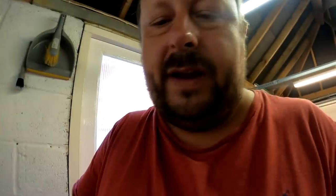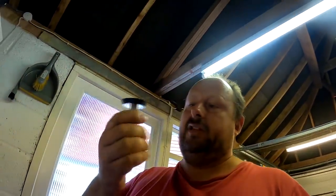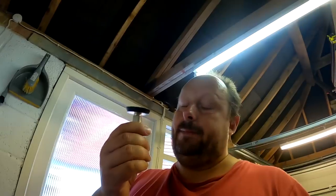You have to be careful because there's a little safety mechanism here. The rotary plate has a little bar in it, so there's a hole drilled in the Flex proprietary 30mm plate so it can fit in. The 75mm plate doesn't have that hole, and that's a means of stopping you putting the 75mm plate on this machine. Flex did that because the machine probably doesn't have the power to handle all the scenarios of using a large pad — a smaller pad is under less load.